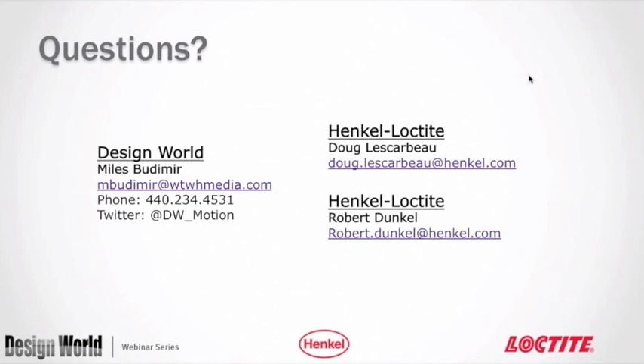Question: are all compounds the same joint strength? For parts needing occasional replacement without a big press, the decision tree in the design guide shows medium-strength and lower-strength products are available globally. Not every application needs maximum strength — the range of standard products can be tailored to the amount of strength required, and the design guide provides product recommendations for medium-strength materials.